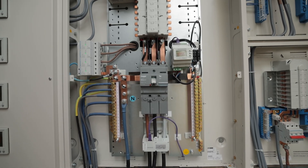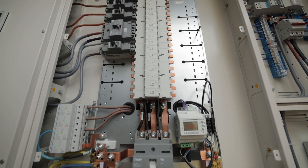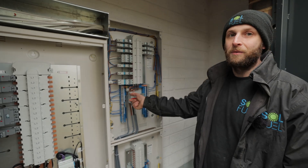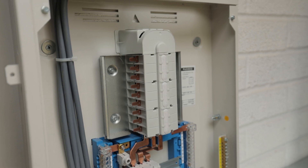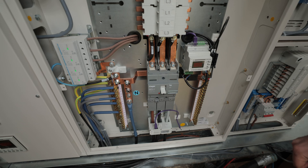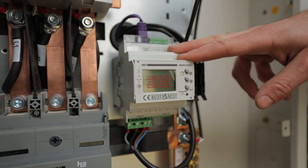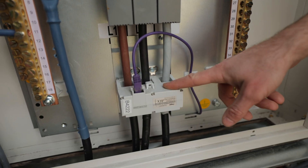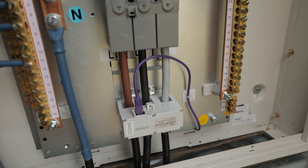The reason we've got a panel board this big for a domestic — rather than your usual smaller three-phase board — is because this property has a 200-amp incoming supply. Standard boards are only really good for 100 amps and don't have much room for cable entry, so we use a panel board rated at 250 amps, which is suitable for the supply we've got. This is our incoming meter monitoring the power for the whole property. It's got a comms cable that links to this CT clamp here — it's more of a pass-through — and that's how it monitors what's coming in and what the property is actually using.